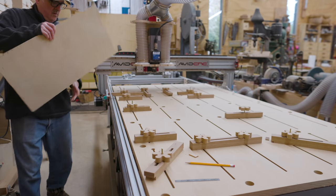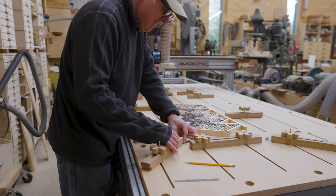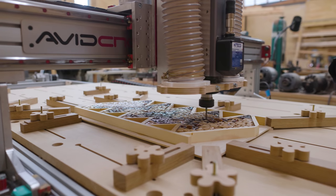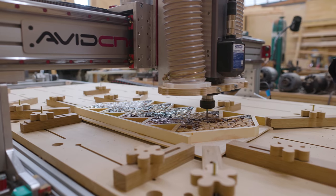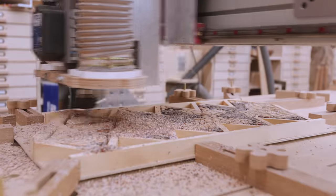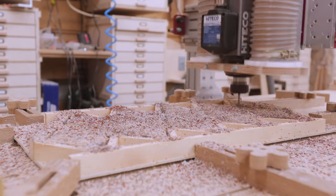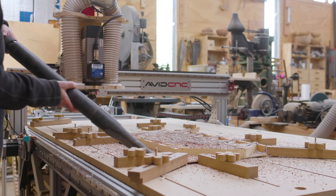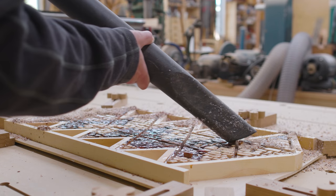The whole piece warped a little bit, which maybe I should have known. It wasn't a big deal — I just had to shim the corners up a little bit under the hold-downs and account for the warp when setting the heights for the router bed. It worked and cut just fine, though it did mean I couldn't cut all the way through on the CNC machine, so I left the plywood backing intact. I also didn't want to run plastic resin dust through the dust collector since that sawdust goes to city compost, so I vacuumed up all the plastic separately.